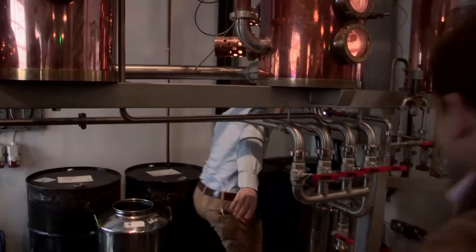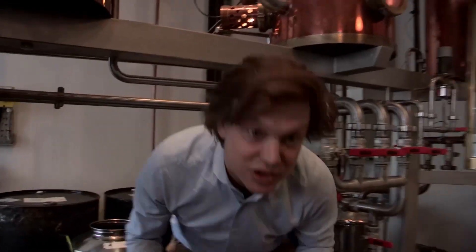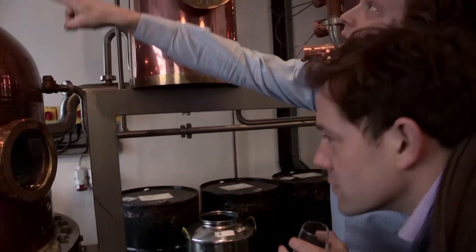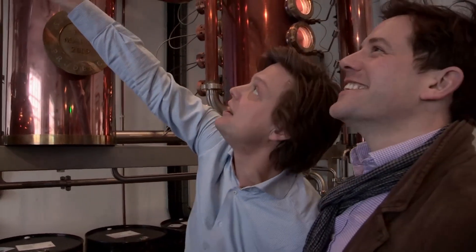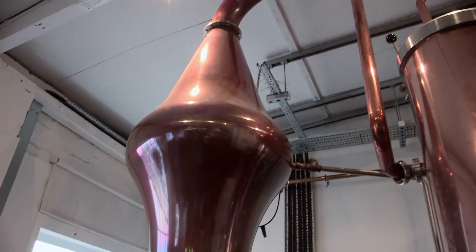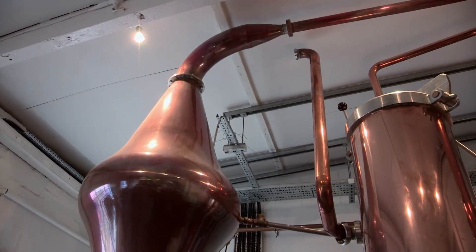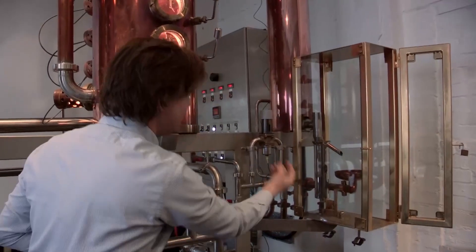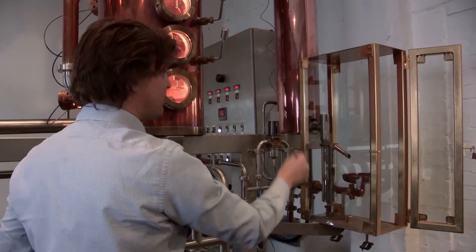What's that? What's going on? Come on, follow me. What we've got now — we'll turn this off. This is just telling us that the spirit is on its way over, and all of this spirit is now converting itself into a vapour, passing up through this helmet here. This is what's called a swan's neck. You've got hot vapour travelling up with the congeners of these botanicals, straight over this overhead pipe and down into this condenser. If you were listening in your physics class, you would have noted that hot vapour hitting a condenser contracts, condenses, falls with gravity into here and out into this spirit safe. We're about to start seeing the beginning of our gin.